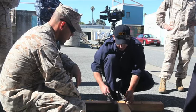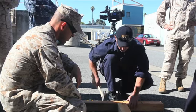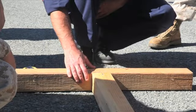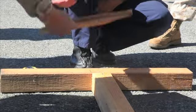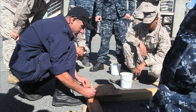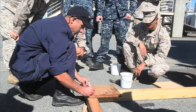So for us, toenail, right? It's really just getting a nail, driving it on an angle, and then just driving it into place. 12 by 12 — the big one? Yeah, the big one. So with this, hopefully this has been cut right — you just start off with the edge, and you put two nails at the edge, two nails at the edge, two nails in the middle, and then you've got the one in the center, right?